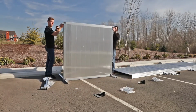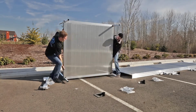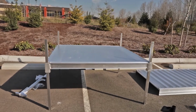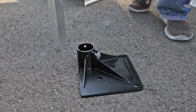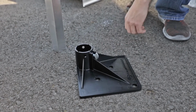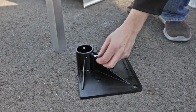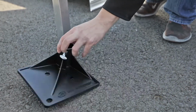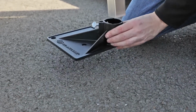Place the platform into the upright position. Lift each corner of the platform and install a foot on each support leg, oriented so that the foot extends under the platform. Make sure the feet are fully engaged on the legs and tighten the thumb screw on each foot securely. If necessary due to site conditions, the feet can be oriented in other directions but may present a tripping hazard if not oriented under the platform.